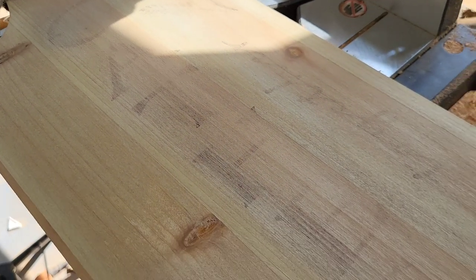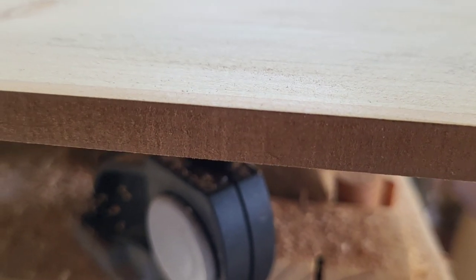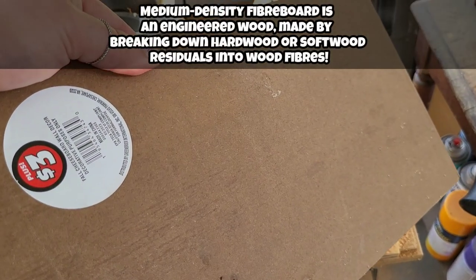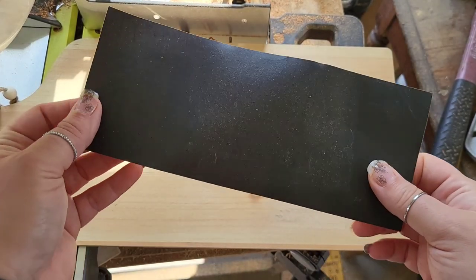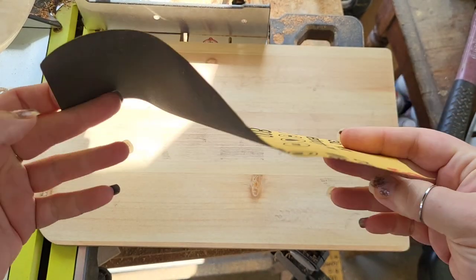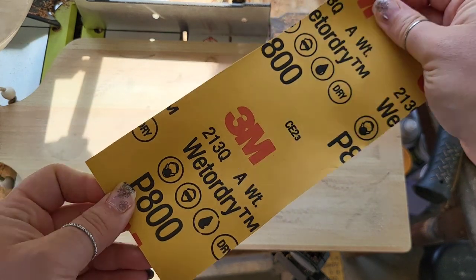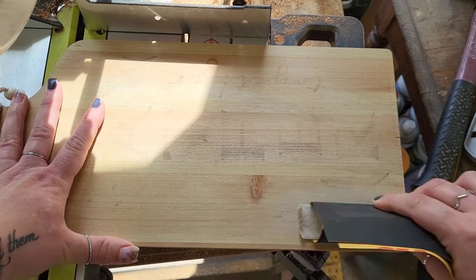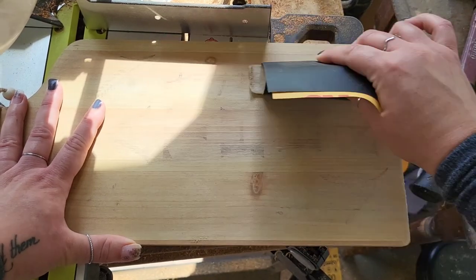Since it was 120 grit, this was a little rough. But I had to be careful, because this is not solid wood — it's MDF. Check out the back; this is a huge indicator. Just the top. So if we would have sanded it down too far, we wouldn't have that beautiful wood on there. Now, to make it nice and smooth, I'm going to take 800 grit sandpaper and wrap it around my little finger sander and go over this to make it smooth like butter.